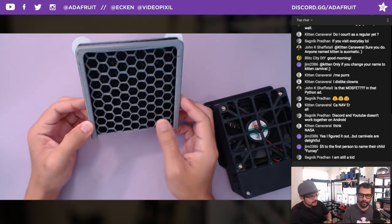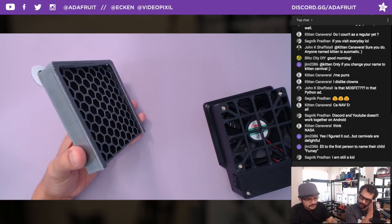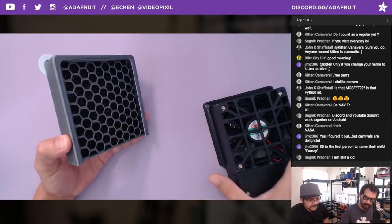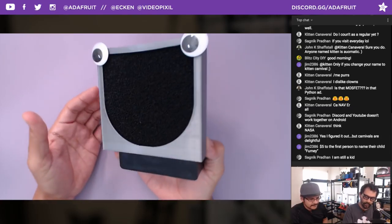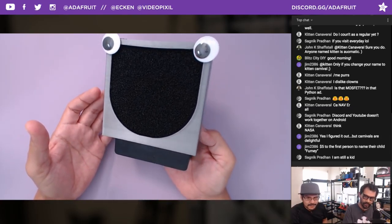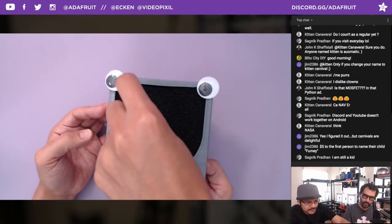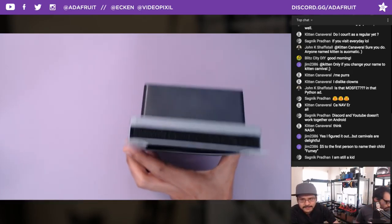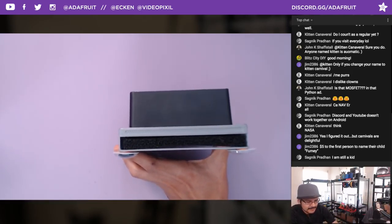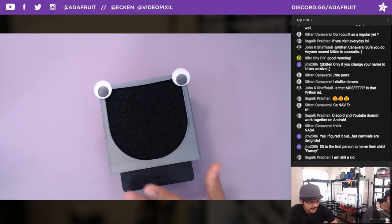That's when the feeder has to pull the material back out so that it doesn't ooze all over these little grid areas. And they're very, very thin, especially for a 0.8 nozzle with a 0.4 layer height, as you're saying. So it's quite impressive. The bridging here, there's no support material. This is just the printer printing in midair, because this is printed vertically. If you looked at the time lapse, you'll know that it was printed vertically like that, with no support material, just kind of bananas.